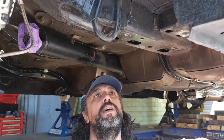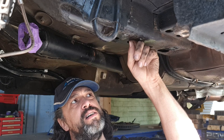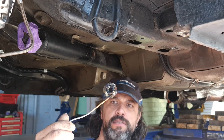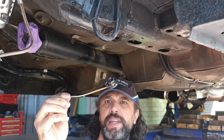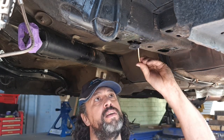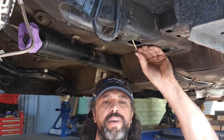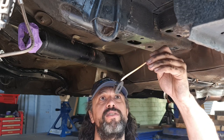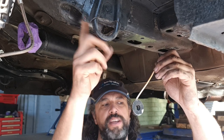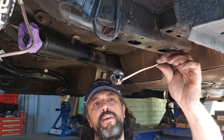Here's a little tip for you: if you've got something like this that needs to go inside a rail and it's just a bit far for your finger to reach, a good little idea is to weld a bit of wire onto it. A little bit of wire — you can bend it, put different angles on it — and then you can fit it up inside your rail and hold your internal nut and washer while you do the bolt up. It's just we've got some rail modifications here from the previous four-link kit, but just put a bit of heavy wire on it and away you go.